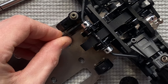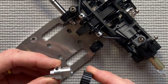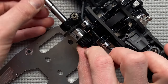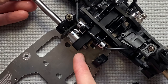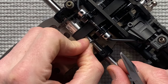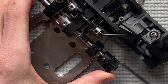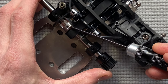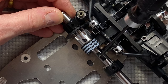Now install the brake dish. Take the main shaft and put the big pulley on the brake dish holder. Put the big clip in the middle — take a big plier for this. And install the side pulley. For the set screw you can also use Loctite. Make sure the set screw is screwed all the way down on the flat spot of the main shaft.